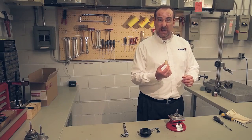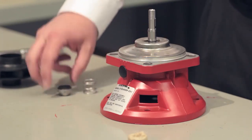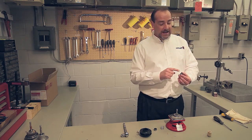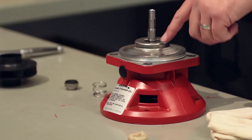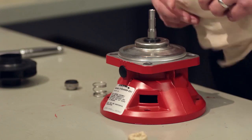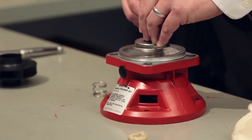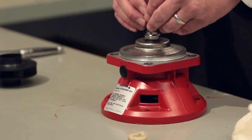When the new assembly first arrives, gently unwrap it and discard the wax paper. The components that make up the seal are: the stationary, the rotating, and the spring for loading. It's really important not to touch the seal-faced surfaces with your bare hands — use a clean rag. Insert the seal cup into the bearing assembly housing using a suitable lubricant, then press the stationary side of the seal in. Take the rotating element, slide it over the shaft, using lubricant as necessary, and add the spring.